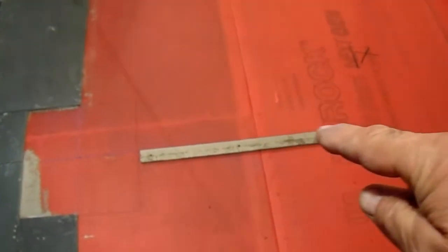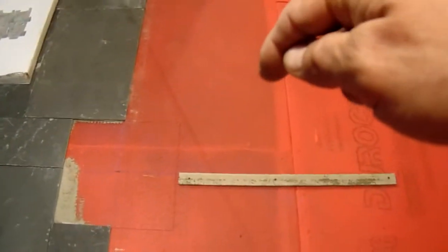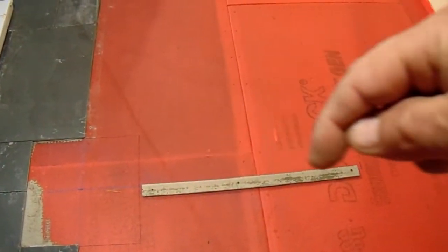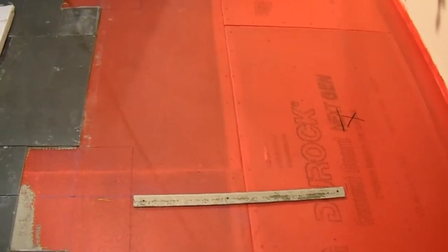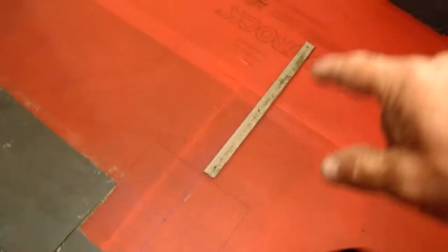Now this one, getting ready to start. First tile going to be freehand, drop that one in, and then the two longest tiles on this section that I'm doing one at a time of this pattern, this New Hampshire pattern, 1, 2, 3, and 4. The first section, my control line will be established. Once that's set, I'll work off of it again and again.